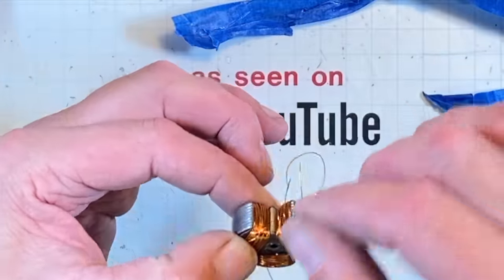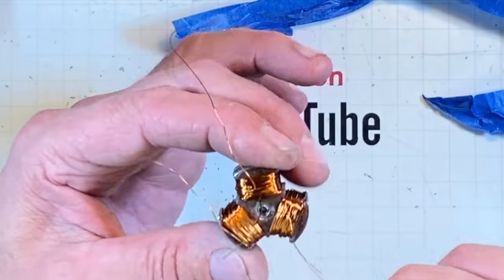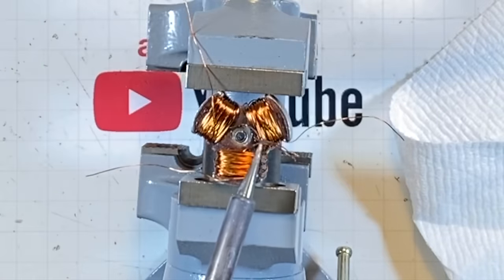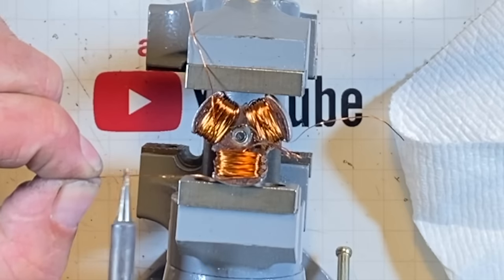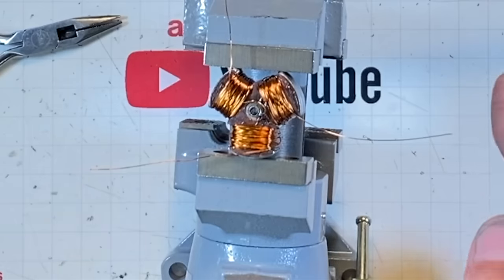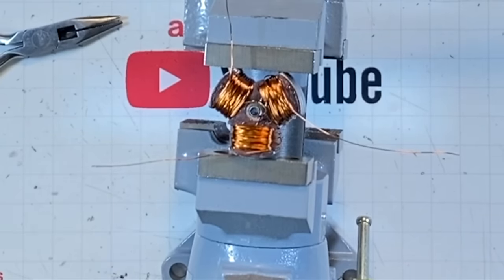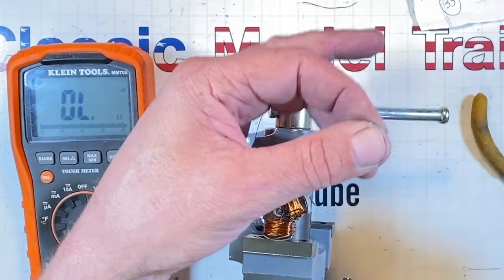Here's my three starting wires and my ending wire. I got to take these three wires and solder them together. A young modeler at the train sale told me that when you want to solder up mag wire, you can burn the insulation off with a hot soldering iron. I sat here and rubbed each wire back and forth on it - you can almost hear it, it gets smooth and then starts to hang a little bit. Then I use some emery board - just scrape on it until it looks shiny copper instead of that red color.